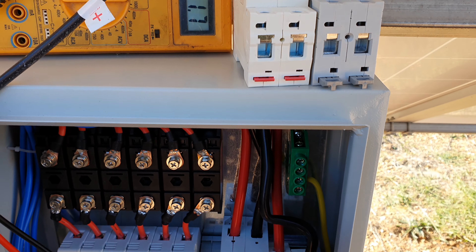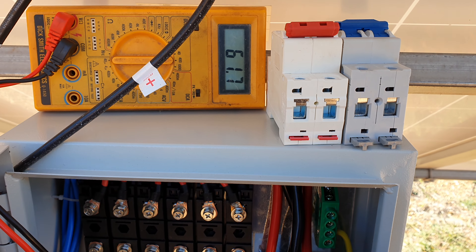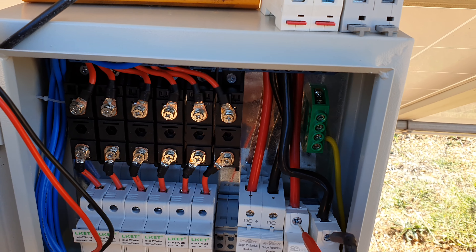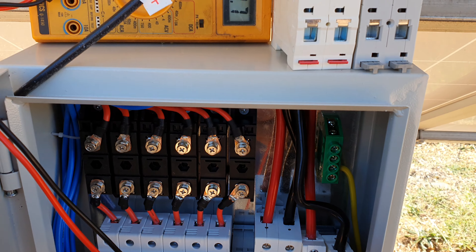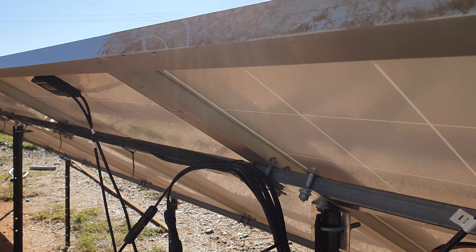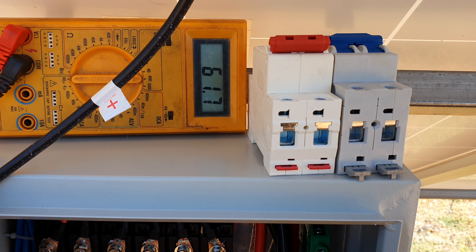This is just part one. What I'm doing is a photovoltaic solar hot water element setup in a little tank — I'll show you shortly. This is comprised of 250-watt panels paired up to give an output of roughly 61 volts. As you can see with the multimeter on there, the panels are just running nicely.